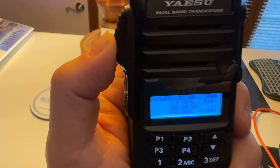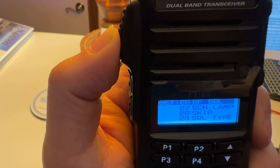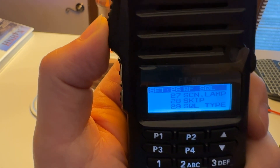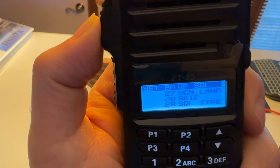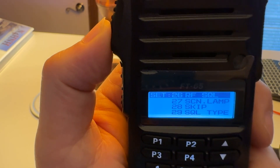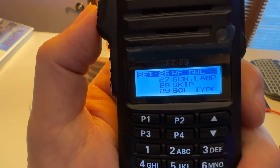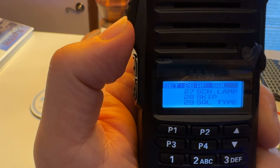What is that? So you've seen how the normal squelch squelches out receiver noise - that shush sound, typical with FM. But what is an RF squelch? This has come in handy for me because I do Summits on the Air, and we're often up on a mountain top where there's a tower site and you can get RF interference from those towers. A prime example: I don't want to hear all the tower noise. If you've ever heard it, you know what I'm talking about - strange digital sounds. I already know I'm not going to be able to hear the weakest signals, but I also don't want to hear the annoying intermod from the tower.